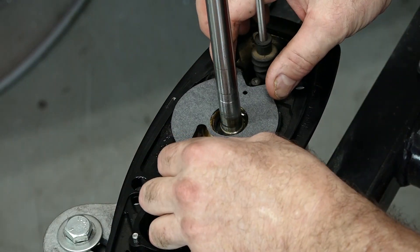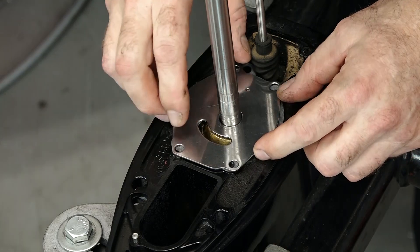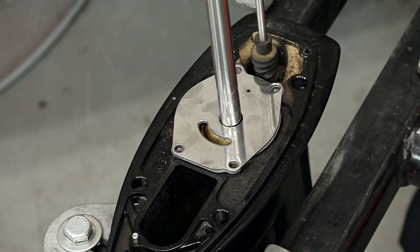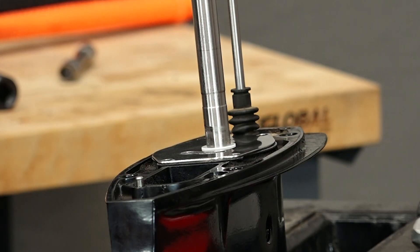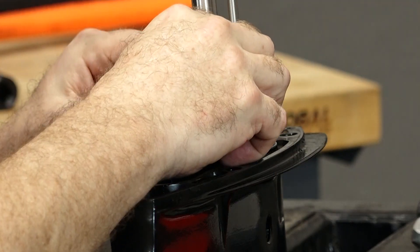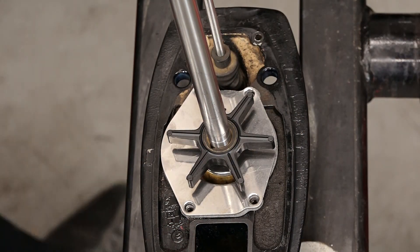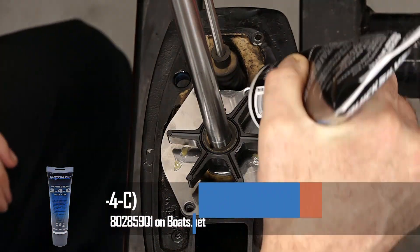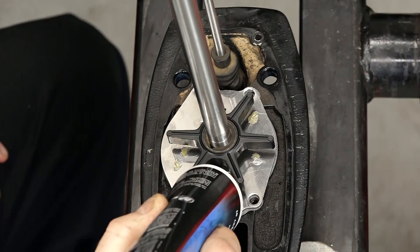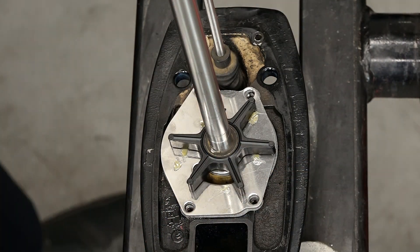All we need to do now is put the water pump back together. It is directional. Then our wear plate goes in. Put in the first nylon washer. Then we'll set this little key that holds it in place on the input shaft. Now we can bring down the impeller itself. Before we seat it all the way, let's put a little bit of grease on the wear plate because on her first start there's not going to be any water up here — we don't want to damage it straight out of the gate. So just a couple little dabs like that will do it. When she starts up, she'll be good to go.